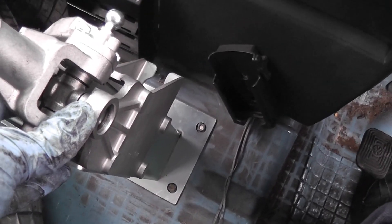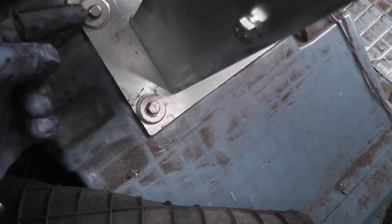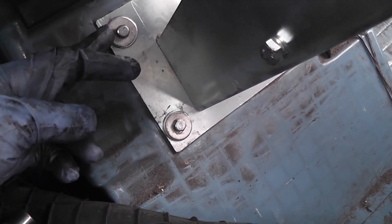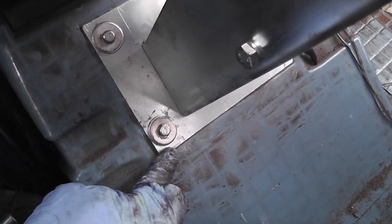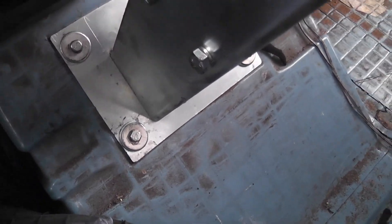What I'm going to do first is bolt down the pedestal. It comes with a lot of washers to take up the space for the captive nuts, because the whole assembly is bolted in from underneath first, and then the cables can be passed up through. The pedestal's in, all bolts are tight. There are actually three washers under there: a lock washer, a large penny washer, and one with a large hole that takes up the space the captive nut would have taken. There's also a nut on the other side for safety. It's nice and sturdy.